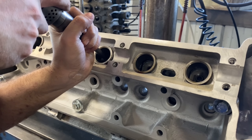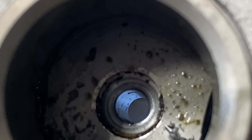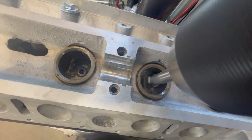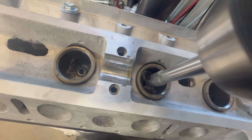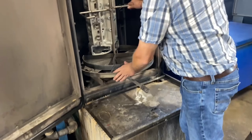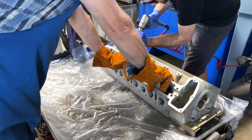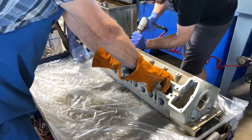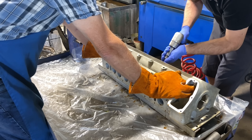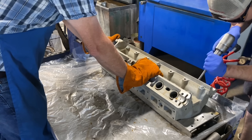Sometimes on aluminum we have to drill out the center of the guide to help relieve the press. After cutting the top off of one I did a test run to see how easily the guide would move — with a few short taps I could tell we were good to go without any additional drilling, so I went ahead and cut all the guides flush. The head actually has a small counterbore around the guide where a circlip is supposed to seat against the head, preventing the guides from dropping. Oddly enough the clips were only included on the intake side and were never installed on the exhaust side — our new guides will have clips on both sides. The factory book recommends boiling the head in water for 30 minutes before driving the guides out, which expands the aluminum more than the cast iron guide helping relieve the press. We ran the head through our spray cabinet which runs close to boiling temperature — the head came out at around 180 degrees Fahrenheit. The fixture came in handy as it supported the head up off the surface of the teardown cart, giving enough room to drive the guides out from the top side while my dad helped hold the head steady. The intake guides came out surprisingly easy, which was a bit concerning to be honest.